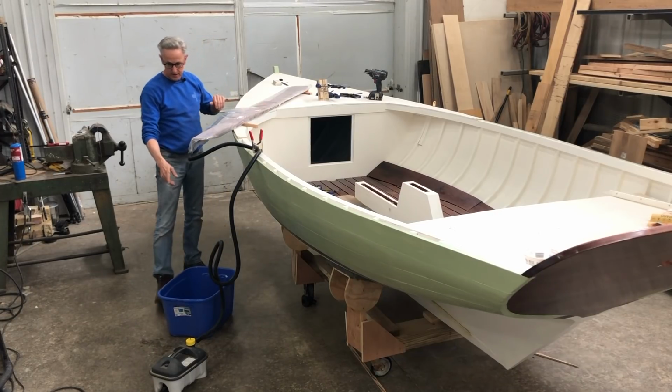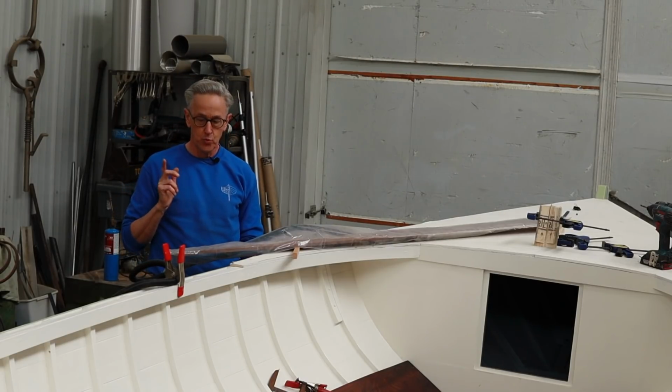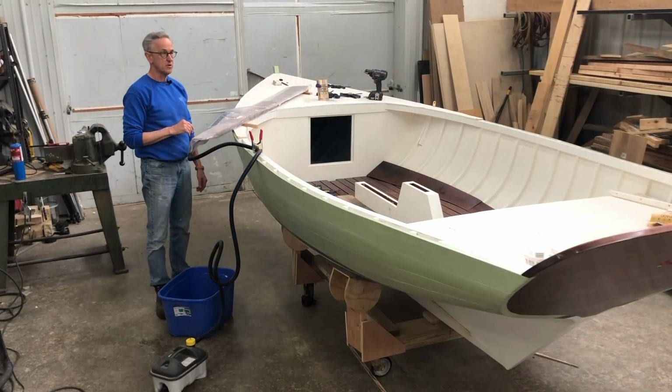So we've got the wallpaper steamer all plugged in and going, and once we get some steam generated, then we will time it. Now the conventional wisdom is 1 inch of wood is 1 hour. So we're at a half an inch here, so that'd be a half hour. So we'll probably let it go till about 45 minutes or so just to make sure. So check back in 45 minutes.